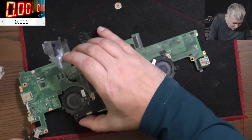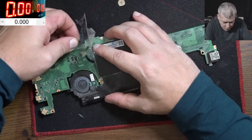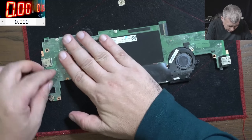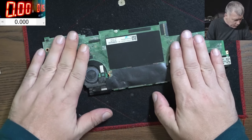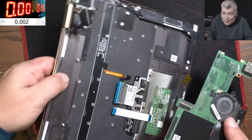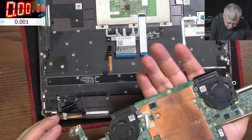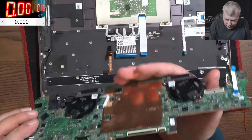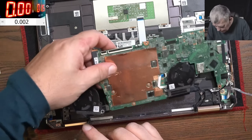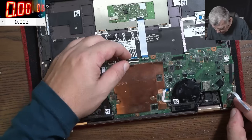Let's check if this board is working - just because we replaced the chip and everything looks fine doesn't mean it's fine. Let's put the foil back. My concern is the board hasn't started. Obviously without the battery there's no CMOS battery, so I was expecting the motherboard to start as soon as the charger is plugged in. But who knows, maybe it will start.